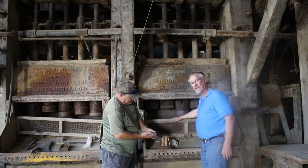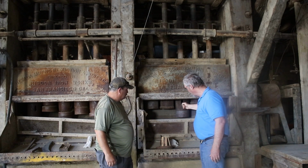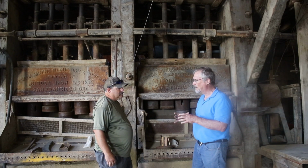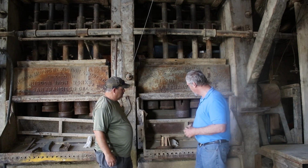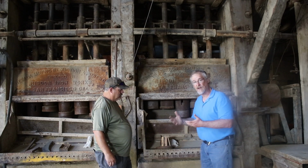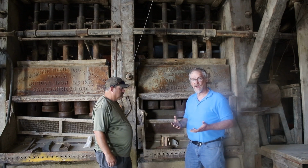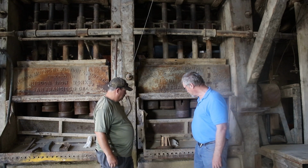Anyway, as they dropped, this thing would be full and have water in it, and so it would be a slurry. And there's an iron pad down underneath that's also replaceable. And as it broke, the stuff would be crushed, and then when it was sized enough to go through the screen, then it would come out and get treated to get the gold extracted. So the first step in really extracting gold from a rock is to crush the rock. I mean, that's what has to be done.